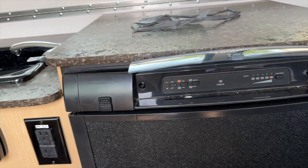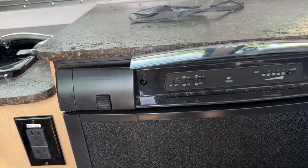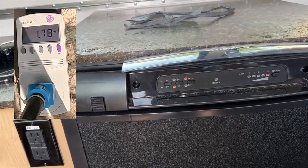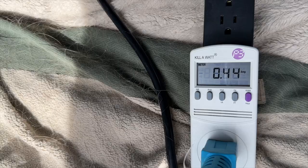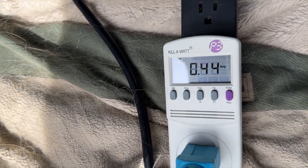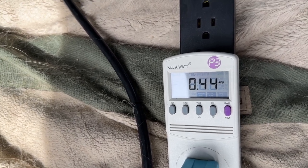I'm going to switch it back to AC just to confirm. I'm assuming you can hear that fan running in the background. I switch it back to AC mode and that fan turns off. As soon as I turned it back to AC mode, the energy consumption went down significantly. So the last thing is to check how much it consumes on propane — I expected it to be the least. It's reading 0.44 amps as opposed to about 1.4 on AC mode — quite a bit less.